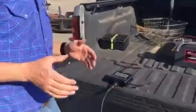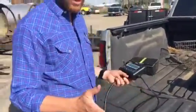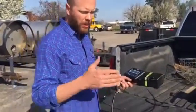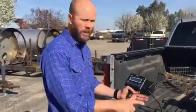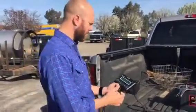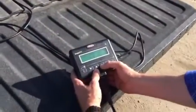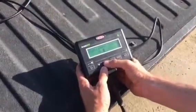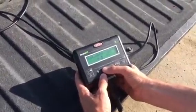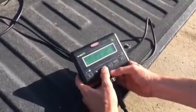You can adjust that a little bit to advance or retard the spray as it's hitting the tree — whether you want to come on early or turn off late. Getting back to the distance sensor: hit OK, up arrow to nine-point-two, hit OK — that's now set.